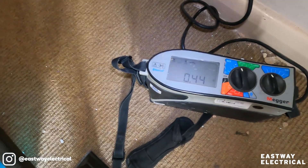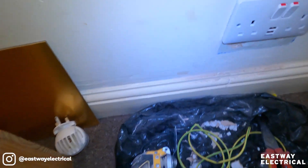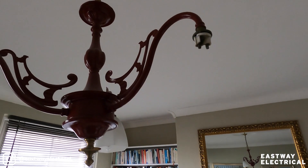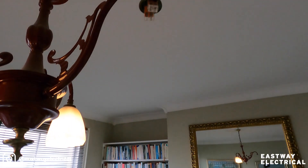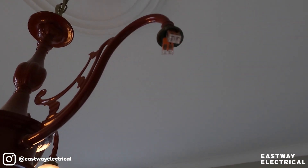That's it all done. The last one — just got to put a test on it now, everything should be good. 0.44 is the highest reading. I'm going to take out that lamp holder and see if I can get a new one, because I think that's what's causing the problem. That's how I've left it — those connectors. It's going to be tricky to fit because those cables are really short. Well, that's all completed apart from that light. I'm going to go to that lighting shop — they've got all those types of bits so I'll pick that up.